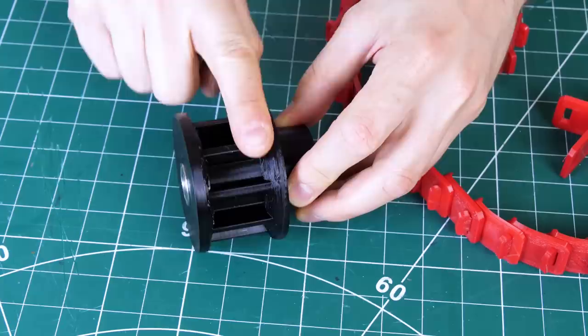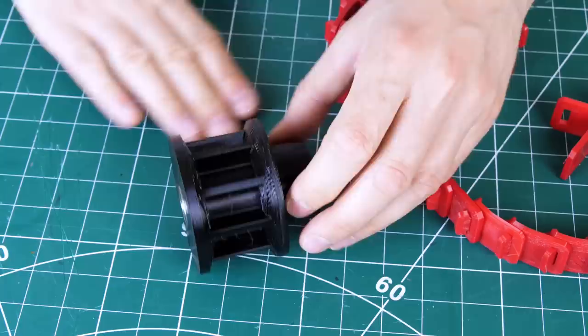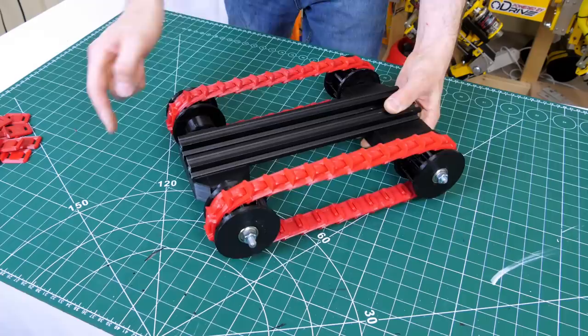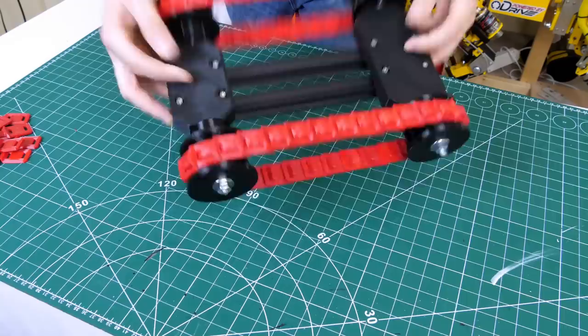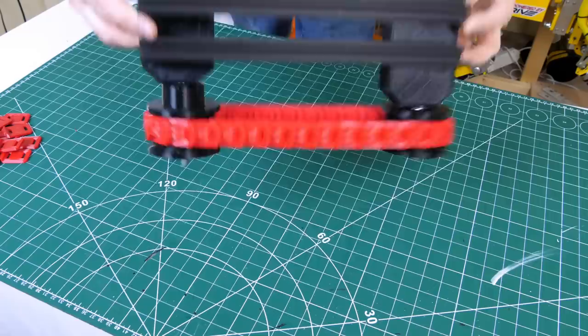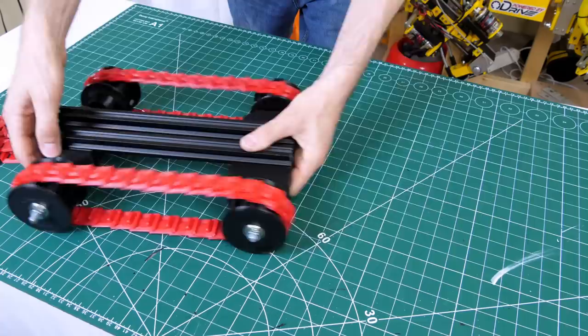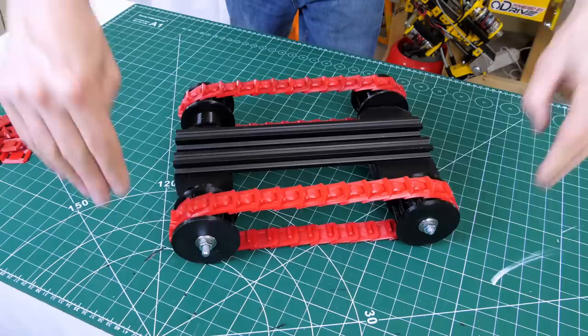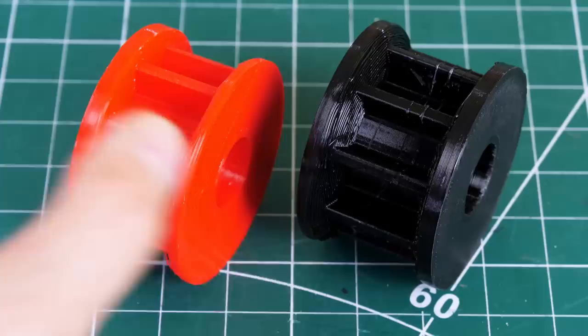I've made the wheel a kind of V-shape, a bit like the original V-belts, but I'm not sure if the belt's going to ride out on the V if the wheel or belt skews. So I'm going to print some more and put together a little vehicle with two tracks and run it on the ground. I've made a simple vehicle with wheels that have their own bearings, 8mm studding for axles, and two 3D-printed blocks attached to 2020 extrusion with T-nuts and bolts so we can slide and tension the belt. The pitch of the wheels seems okay, but the belts do ride up on the V as I feared — this tensions the belt too much, gets lumpy, and eventually the belts come off. So I'm going to redesign the wheels to remove those slopes and just have hard edges.